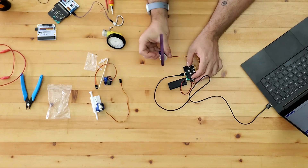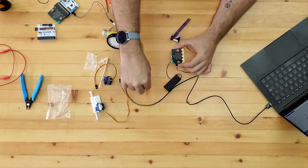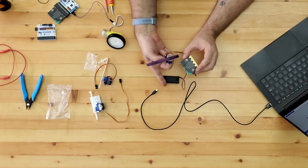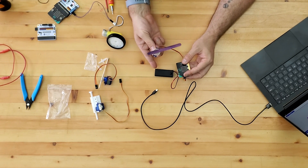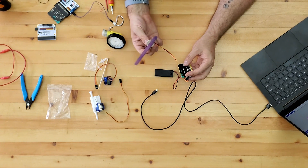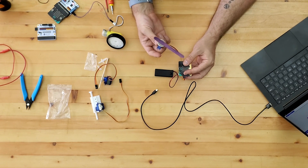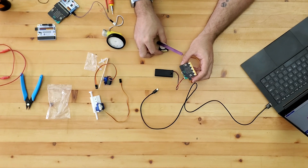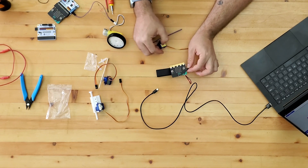Continuous servos will work fine, but if we take it off USB power onto battery, it's slower and doesn't have as much power. These servos were bought specifically because they work well at three volts, but when batteries are not fresh they won't work well at all. Running on just the normal battery pack is workable but not ideal. If students find it's not moving well, it could be the power — try fresh batteries to improve that.